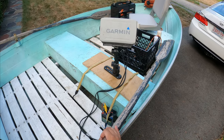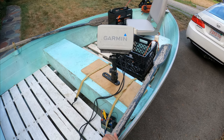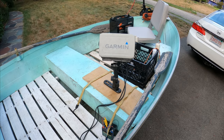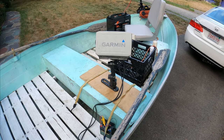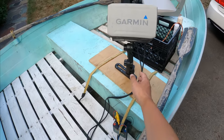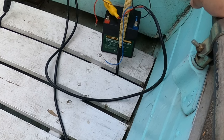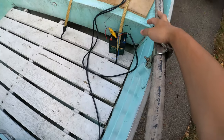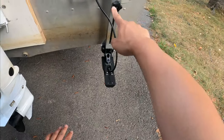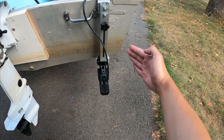It is very important to have a fish finder with maps — the depth charts — so you know where you're going and how deep it is to avoid hitting rocks in the water. This fish finder is also great because it has a chart plotter function, so you can plot depth charts on new lakes where nobody knows where the underwater structure is. It also has side imaging, which is helpful for finding suspending crappies. I put it on a kayak fish finder mount — I'll put the link in the description. The battery I'm using is a lithium iron phosphate, 12 volt, 8 amp-hour, good enough to power the unit for an all-day fishing trip of 8 to 10 hours. The transducer is right here — I used a transducer mount from Bass Pro, it only cost me 30 bucks. I have a video introducing this transducer mount if you want to check it out.